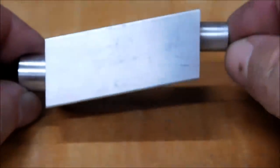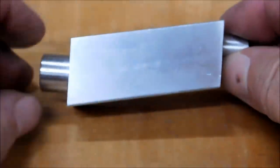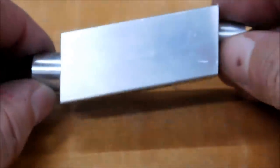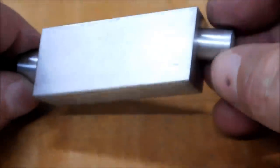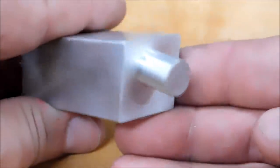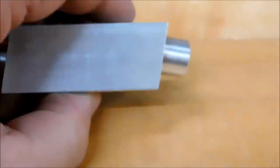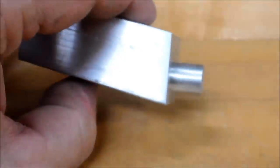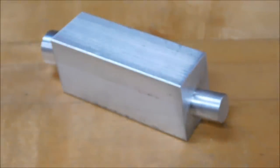You need to turn an angle, and naturally this particular technique is governed by the length of the part and the severity of the angle. If the length of the part is too long, it's not going to get down inside your spindle, so it's probably going to have to be done on an angle plate backboard the way I just showed you, strapped to an angle plate. And that's what I call a zero deflection setup. That's a topic for another day, but it's coming. Okay guys, I hope you like the two different ways to do that. No big deal. Thanks for watching.